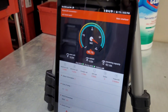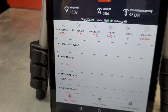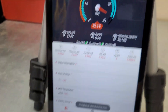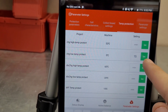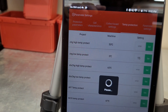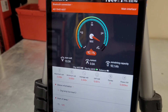I've had the Tezi Power battery in the fridge for about four hours now. It's coming down to a little bit colder temperature, but it's taken a while — these batteries are pretty well insulated. Our main temp sensor is at 13 degrees Celsius. The battery is ice cold on the outside, but obviously it's taken a little while to get into the actual sensor. So I am going to go to our settings, our temp protection page, and I'm going to change our minimum temperature to 15 degrees Celsius. Password is 123456. So we've changed it now, and we should be able to put the charger on it and it should lock us out — give us a low temp protection, activate the heaters, and prevent charging. Let's have a quick look.